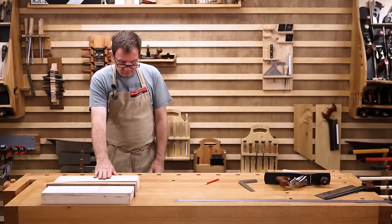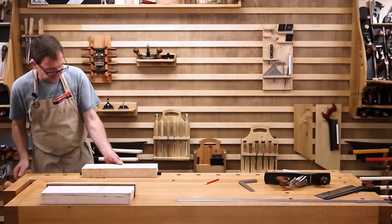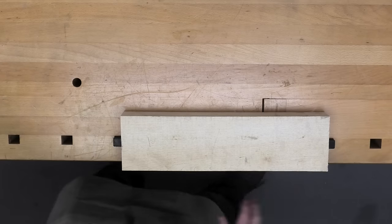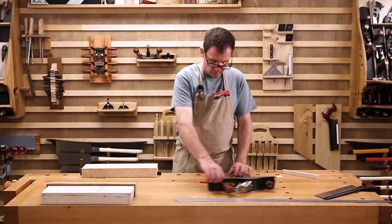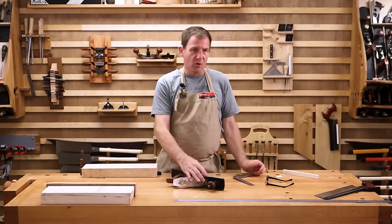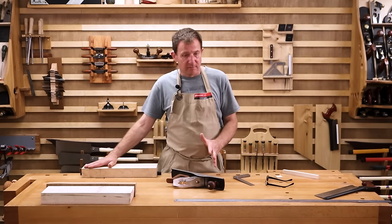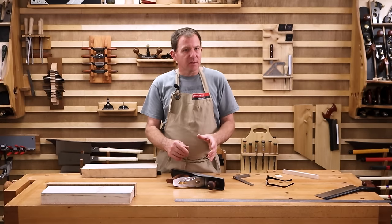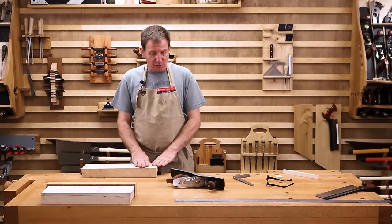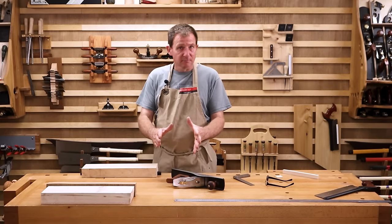So first board we're going to bring in, going to hold it somehow in our bench. So we've got a tail vise, going to clamp it in. You could go normal vise, doesn't matter. First thing we'll start to look at, what are we going to use to do this with? We want a hand plane. You could have whatever you like. Could be low angle, could be a number four and a half, could be bigger. The longer the plane, the easier it is actually to flatten and get this nice and flat. So a four, yeah, it'll take a bit more effort. Five will be better to work with. Nice, slightly longer, so it's gonna help me get that flat edge. Don't go with something too heavy, too short like a block plane. No, you're not gonna get it flat. It's gonna be tricky to do.